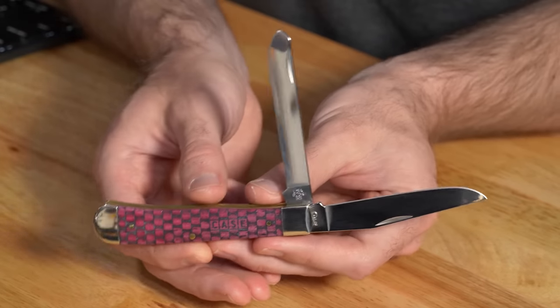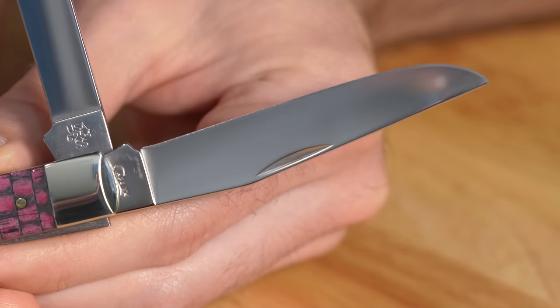So a mirror finish or a polish finish — there's mirror and there's polish. A mirror would be a polish finish, but a polish finish is not necessarily a mirror finish. We're going to group them together. Essentially you have your base grind on the knife, and you slowly start working up in grits to get a polish finish. You start with your 300 grit belt to take off metal and get your general shape, then you keep going up until you get either a polish finish or in some cases a mirror finish. This Case knife is more of a polish finish because you can still see some striations from whatever compound or belt they used. If you go really high on the polishing compound or grit level, you get rid of all of those and get what's called a mirror finish.